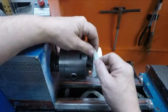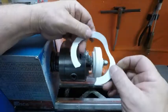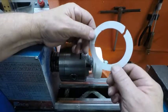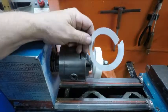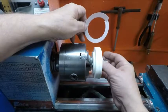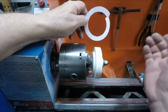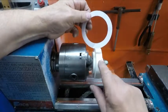You could actually make plastic washers out of this if you needed like a shim, a thin shim. It's amazing — this plastic. Wow, there it broke, but you can see it's paper thin, and that would work. They had plastic stuff like this up at the plant when they worked on machines, to kind of shim things a little bit. You could make it thicker or thinner. It wouldn't be to seal like gasket material, but for shims it'd be great. You could make shims out of this. So, what I found was when I machined this, I put the vacuum up here and held it — it just sucked it right in. It's so light, it went right in. And it's really nice stuff to work with. That plastic is amazing. It is well worth the money. So, I can get two out of this.